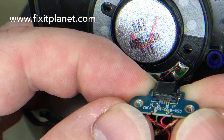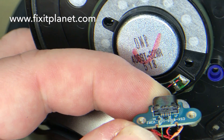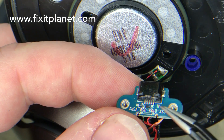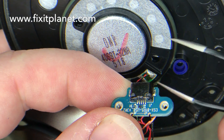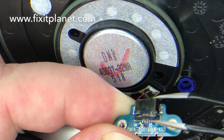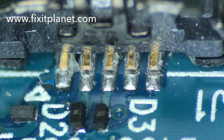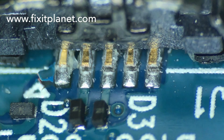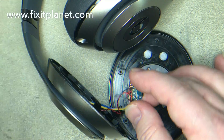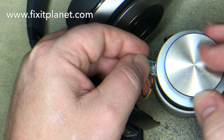I'm going to bring these up as close as I can and point out that none of the pins are actually soldered anymore. The far-left pin actually has a torn trace. So we're going to re-solder the four pins that are still intact and we're going to bridge the broken trace. Here's a close-up view — you can clearly see those pins are not soldered down. It doesn't look like they ever even had solder on the tops of them, and that left side has a broken trace. In this case we don't really need any jumper wire.